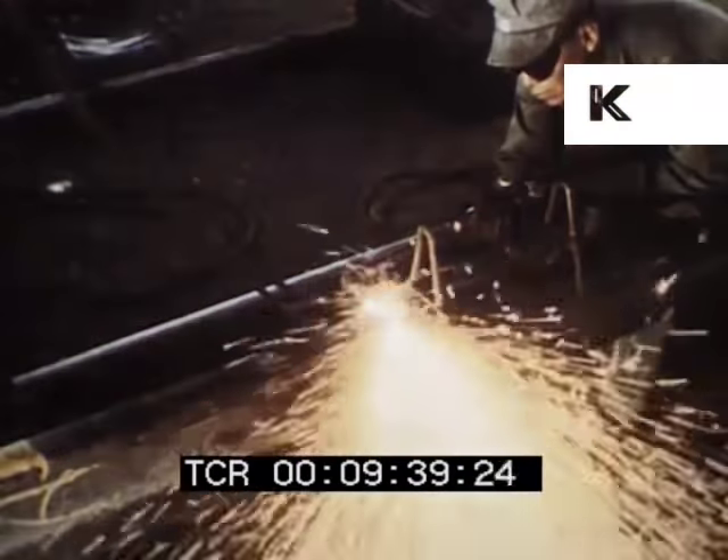Now we proceed to the process of laying welded rail. In this operation, a 112-pound jointed rail was replaced with a 136-pound welded rail. Two bolt machines remove bolts from the four-hole joint bars, beginning the process of removal of the old rail. The seven-and-a-half-ton crane lifts the long rail from the embankment shoulder to the center of the track, where it is placed on the old joint bars spaced several rail lengths apart. The crane takes a new hitch approximately every 50 feet.